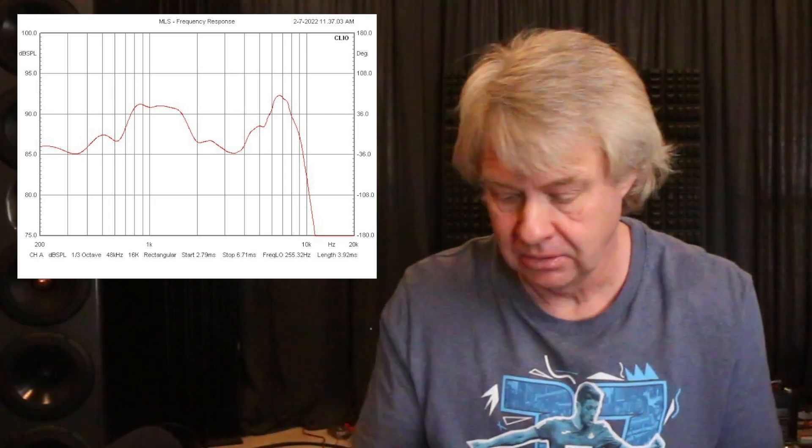In this case I used this type of notch filter - it's called a series notch filter. The reason I did that is because there's already going to be an inductor in line with it, and that inductor causes an increase in impedance as frequency increases, making it harder for higher frequency to pass through. So we already have a range there where the impedance is going up, and this type of notch filter shunts power back to ground and will bring the impedance in that range back down - so it's more ideal for this application.